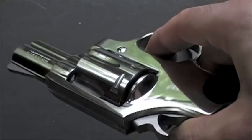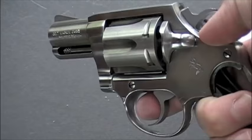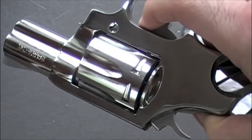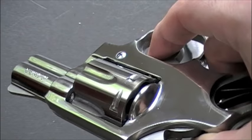This took me about two and a half hours to get to this point. But it's worth it for me because I like the look — I just sit in front of the TV and polish. I watched two episodes of Top Gear while doing this. That's all it is: easy technique, it just takes a lot of time. Avoid Dremels, avoid doing it by power — do it by hand, enjoy it, take pride in what you did. It's okay to use the Dremel for tiny little corners, but be very careful to never let the shaft touch the gun. That's how you polish up a revolver.